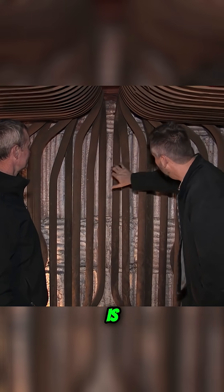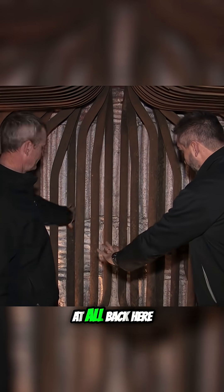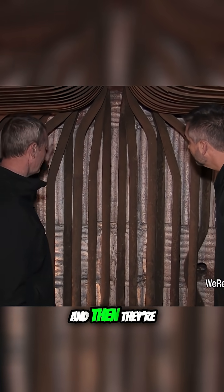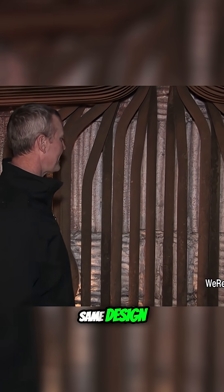The first thing I see when I get to the back of the wall is that there's some more blanket back here. No refractory at all back here. The same style that we have in the front wall — these are all modules pressed in here, and then they have a spray put on them to seal them and keep them rigid. Same design.